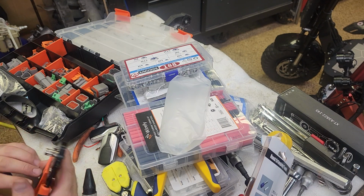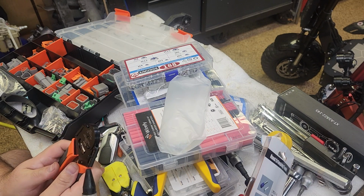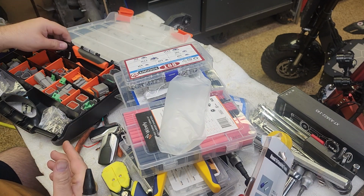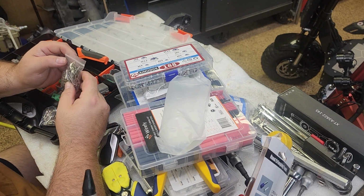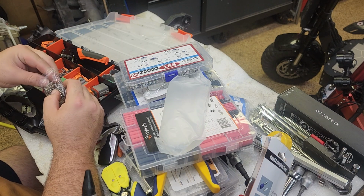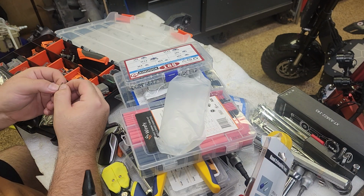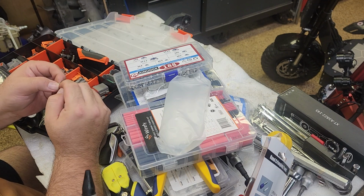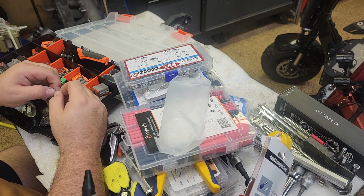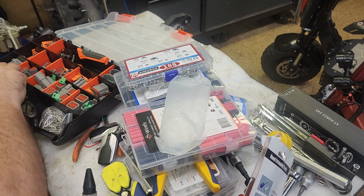I mean, this is good for this setup. This will get you pretty much where you want. There are some advanced crimpers. I'm looking at getting the advanced one, the military grade one. You can tell the higher end pins. I don't know. Let's see if these ones have it. Yes, they do. So some of the higher end pins actually have an inspection hole. I learned about that. So the inspection hole will verify and make sure your conductor is, you can see that your wire is down far enough. And that's one of the big things, like the military connectors. So they know that there's a solid conductor in there. Good connection.